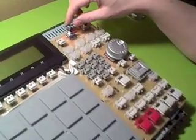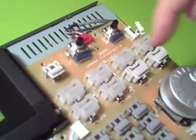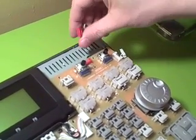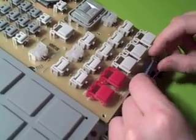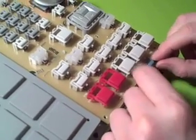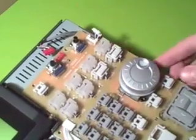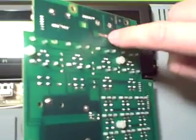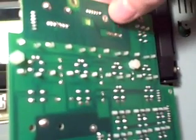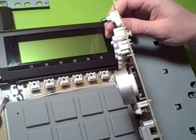So this is the problem right here — it's this rotary encoder. This one's all bent to hell because it's the one I already yanked off the board. There are wires connected here — I struggled to pull them off, so be careful because they can break. I broke a part of something getting a ribbon cable off, and I broke one of the plastic latches that holds it on. I'll use some electrical tape later to make sure it holds. I left the ribbons attached and just lifted the board up at an angle, then heated up the back of the rotary encoder with my soldering iron until it was loose enough to pull out. It got all bent to hell, so no using that again.